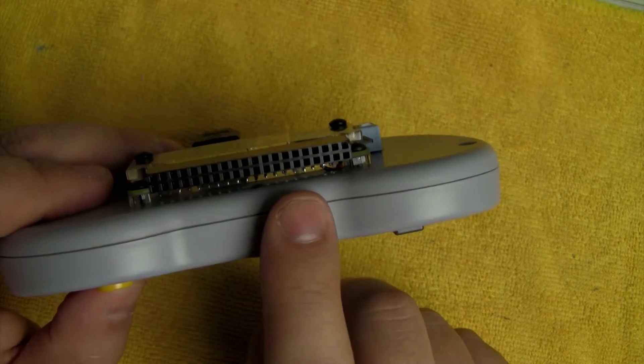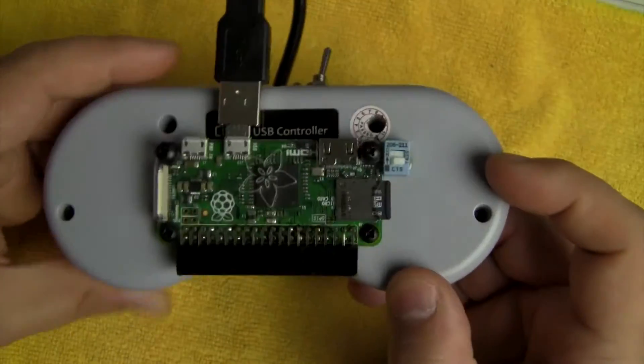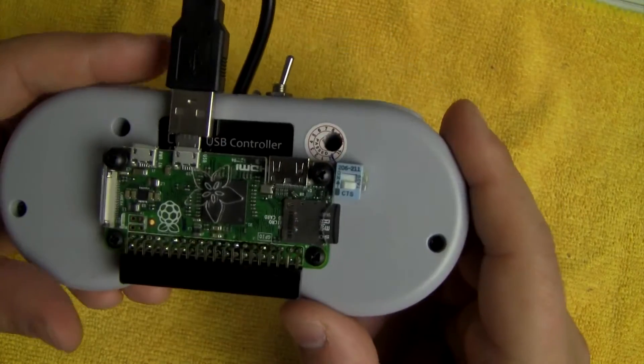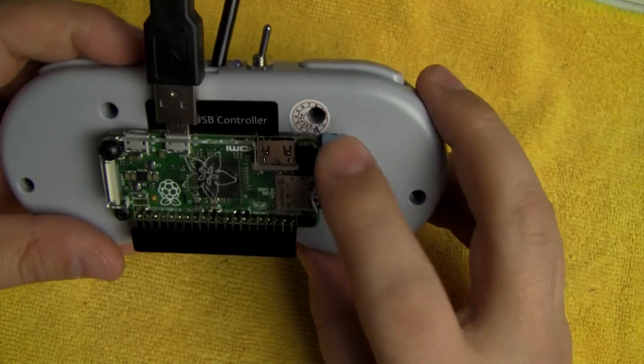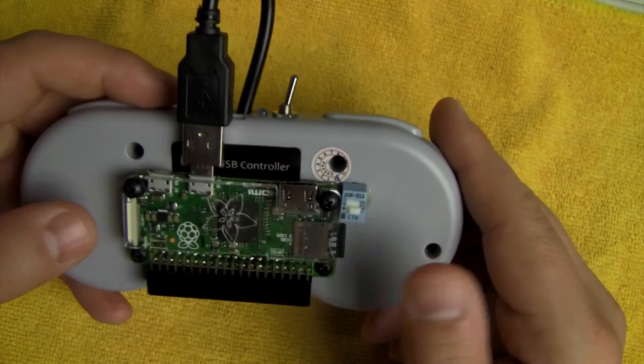I only have a black and a red wire coming off it, which are ground and 5 volts. That's where the DIP switch comes in — those wires run directly to the DIP switch, and in the off position it completely isolates the Pi Zero from the internal wiring.